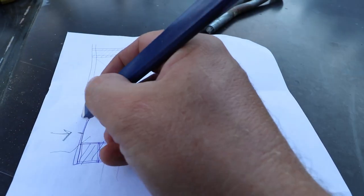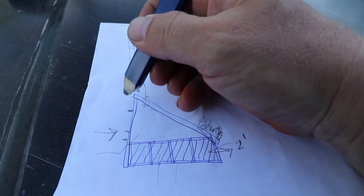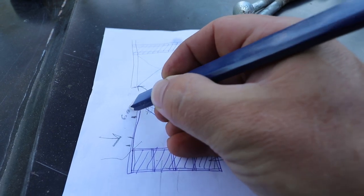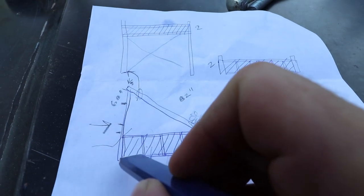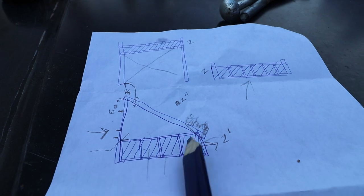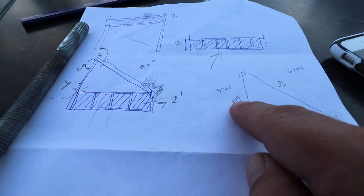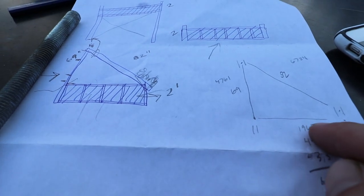And we know that this dimension over here, from the top of this wall to where this eye bolt enters, is 72 inches minus 4, so that's 68 inches. Because the bolt is 4 inches recessed from the top, and we have a 2 foot wall here. So what we're trying to solve for is how long is this wall? I went and did a couple of double checks, and it turns out our eye bolts are 3 inches recessed from the top. So our side height is actually 69 inches. We can solve for this third side here